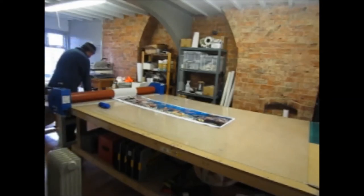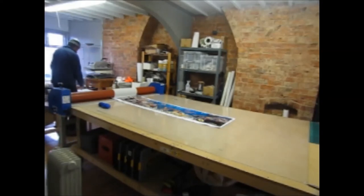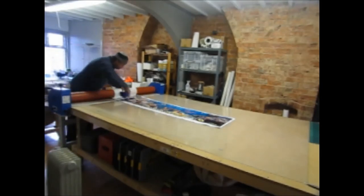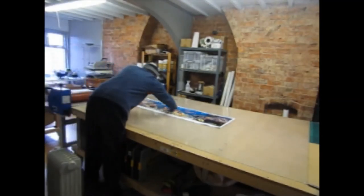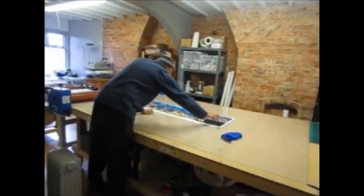Before I'm ready to go, I don't want the job to drop onto the floor when it comes through, so I've got a small easel — in this case a stool with a piece of cut-off aluminium composite — placed at the back so the job rolls onto it and won't touch the floor, avoiding picking up dust. Before I start, I take my clean microfiber and give the whole job a quick wipe over. You can use a tack cloth — just be careful not to apply too much pressure or you'll leave grease from the cloth on the job. I'm looking for any defects or small particles.